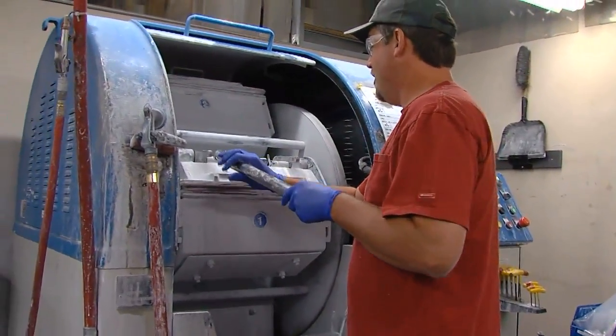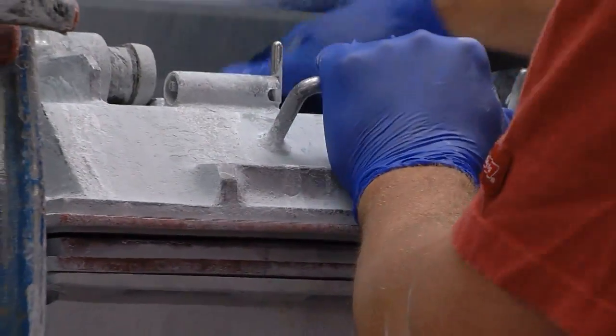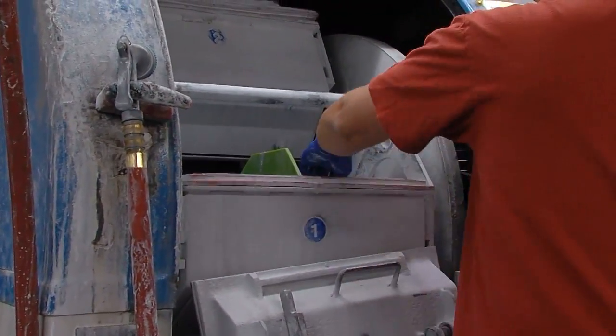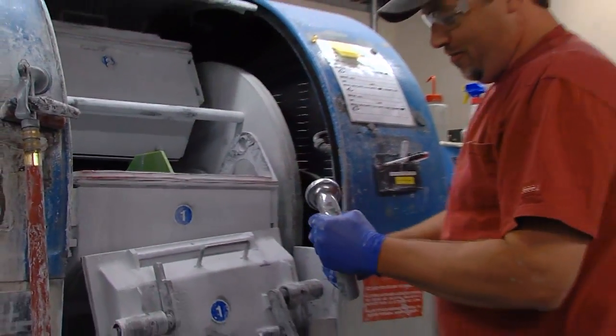After the cone process we're going to put it through a corncob process that turns it bright and shiny. Brad will go ahead and take out the very finalized piece. Some processes are wet, some are dry — in this particular one the corncob accomplishes a bright shiny finish. We used to have to polish them by hand, with hours and hours of work, and you'd get a very inconsistent process.